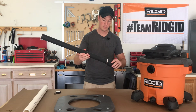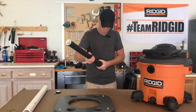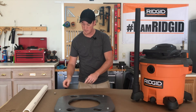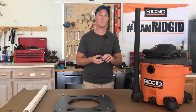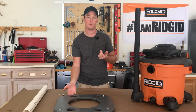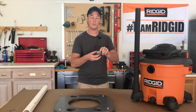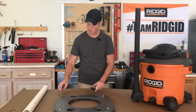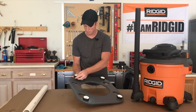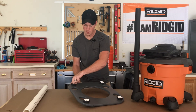The one and a half inch pipes are about 28 inches long. To attach the plywood top to the pipe, they make PVC table caps — furniture grade — that would have been perfect for this. They're basically like a cap with little tabs on it where you could screw to the plywood. But I couldn't find any locally. You can order them online if you'd like, but I just used a normal cap that I drilled a hole in. Then I drilled the hole through the plywood, got a bolt and washer, and bolted all four on.